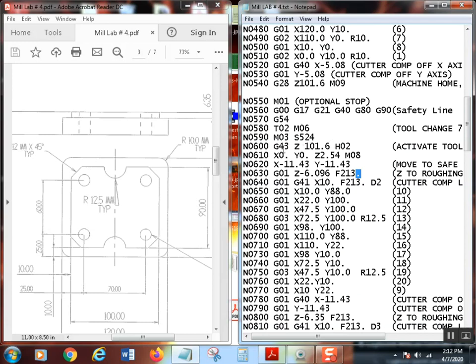We're coming down, same thing, activating our tool length offset. I got another little problem right there, let's fix that. Control S. Okay, activate my tool length offset in a move, and it'll rapid down to 4 inches above the part. Remember, the H number always has to be the same as the tool number. The H number and the T number have to be the same.